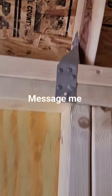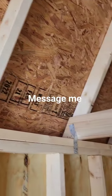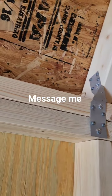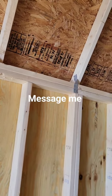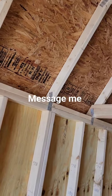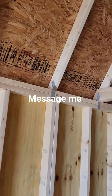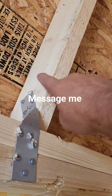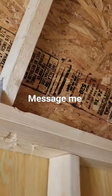I want to pay attention to the roof trusses. We attach our roof trusses using metal hurricane straps — or hurricane clips — which is a very strong, sturdy way to attach a roof truss. Because of that, we engineer certify our buildings to 100-150 mile an hour wind gust certification. Some of my competitors do not use metal hurricane clips, which means a big strong wind could separate the roof from the rest of the building — but not ours.